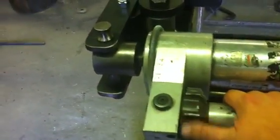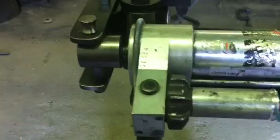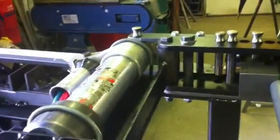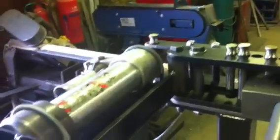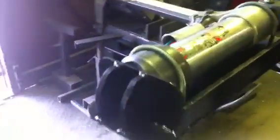If we push it forwards and backwards it actually makes the ram move in and out. We put it on our own bracket which bolts to the end bar as you can see here. This is a 50mm bit of solid rod that we've drilled out to take a 26mm hole to take the dowel that's already there, then clamped it down with two new brackets front and back, and put a nice solid back stop on it so that it can push against.